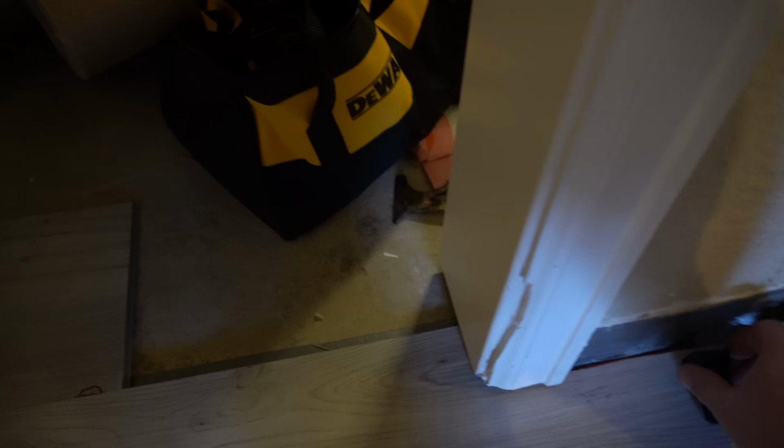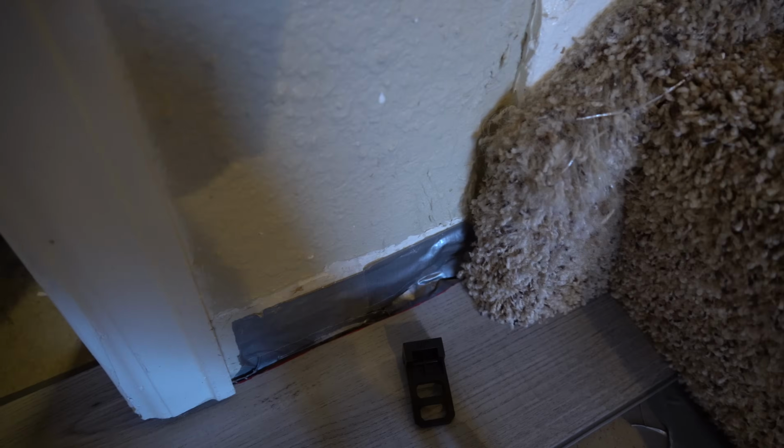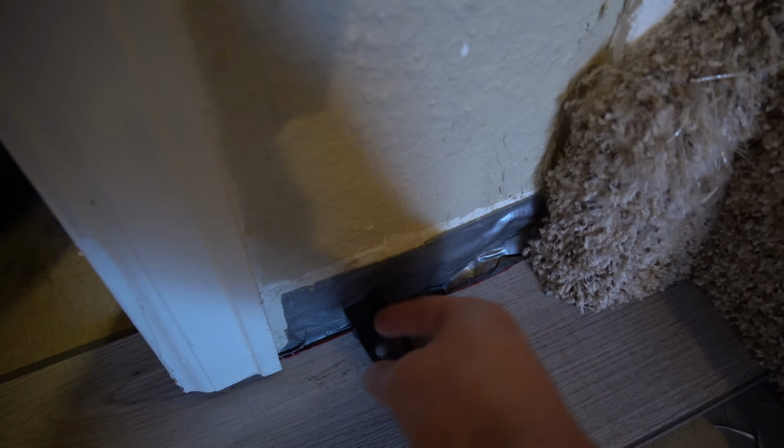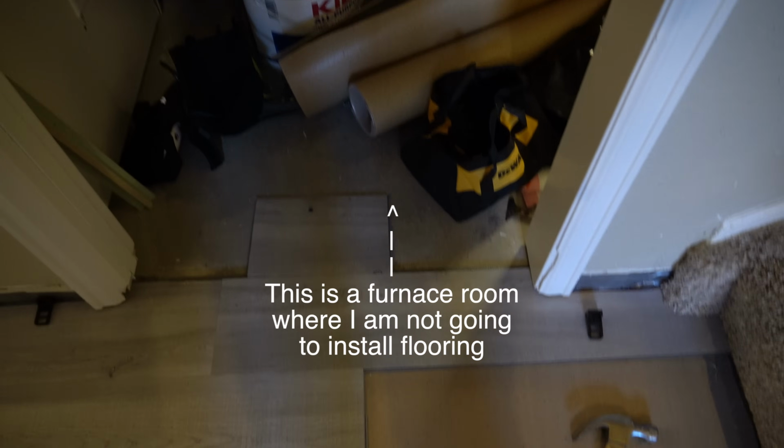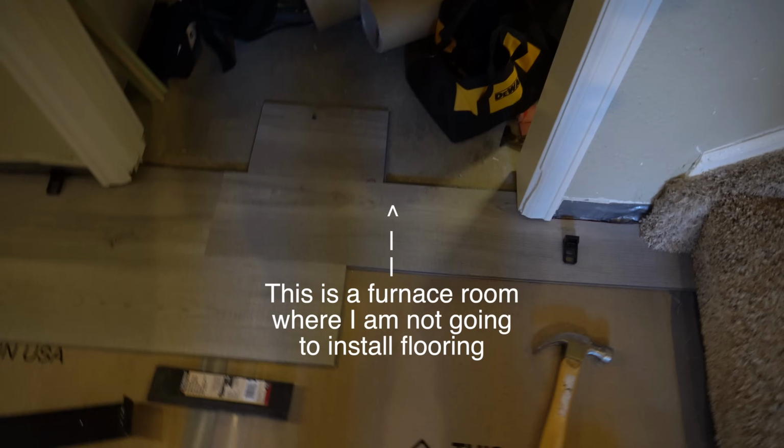The issue I ran into is, coming through the hallway here, it had a spacer there. You can see how the drywall just moves. And then it's sturdy here. So this isn't a sturdy backing even on this side. So as I go to tighten up this hallway and hammer in my stuff, what's going to happen is it's going to push back and start to go into that hallway and nothing's going to tighten up.